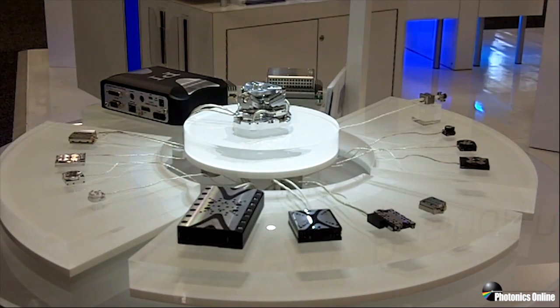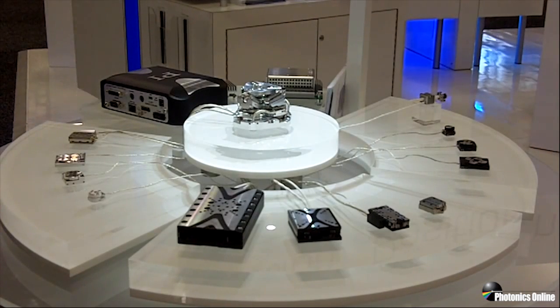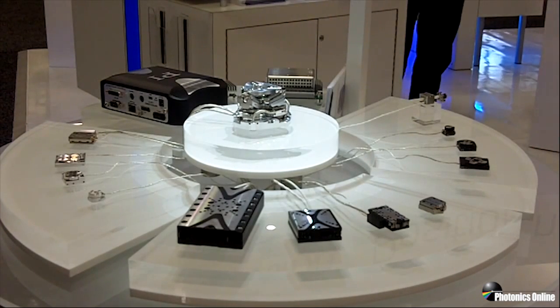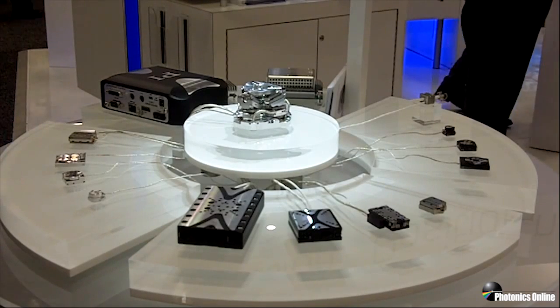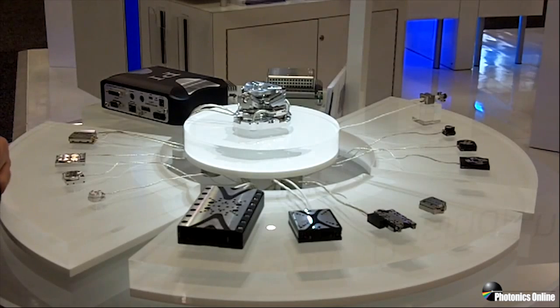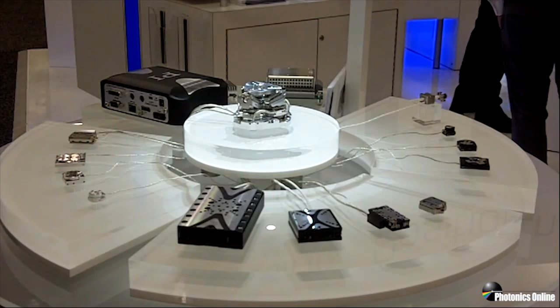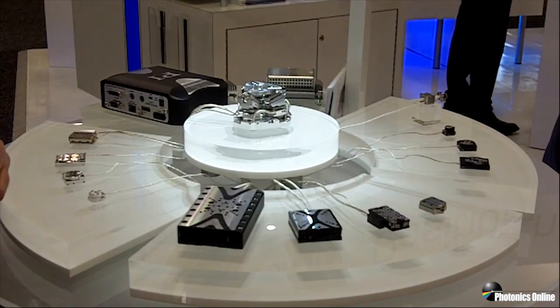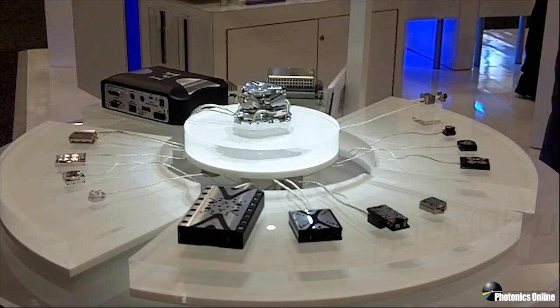This is another type of piezo device — the latest family of piezo-motor stages that we've introduced. We have several families. The difference between a piezo-nanopositioner and a piezo-motor-positioner is that they both use piezo-ceramics, but in this case the piezo-ceramics are configured to provide extremely long travels in an extremely compact package.